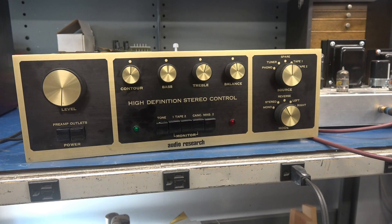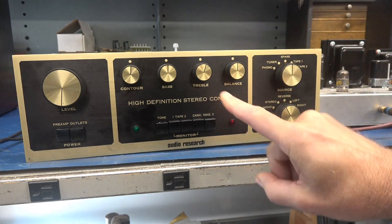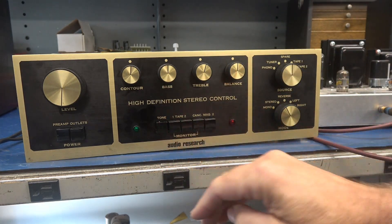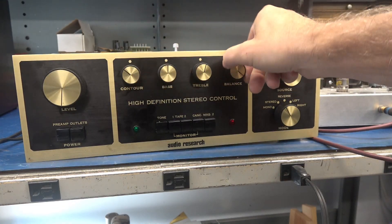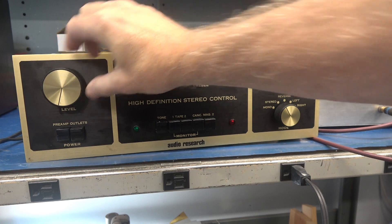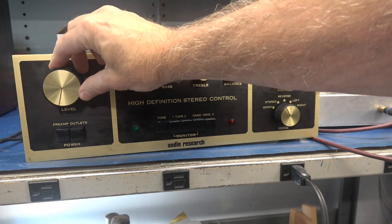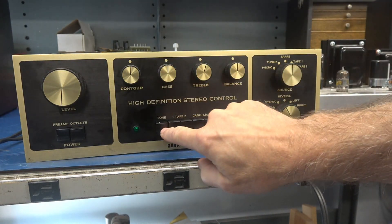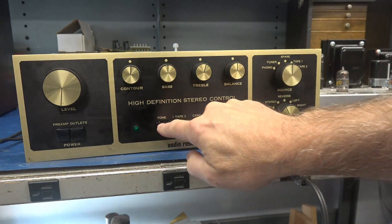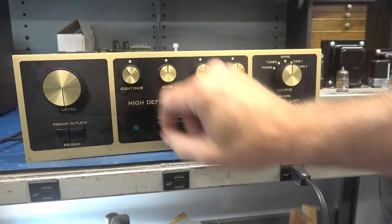This is a re-test after changing out that contour pot. Here's our balance — I'm going to turn on the tone switch. We still have the swelling unfortunately, but the balance is now correct. I also noticed that after you've cycled the tone switch you don't get the pop. So something is actually charging — there's a capacitive effect happening here.